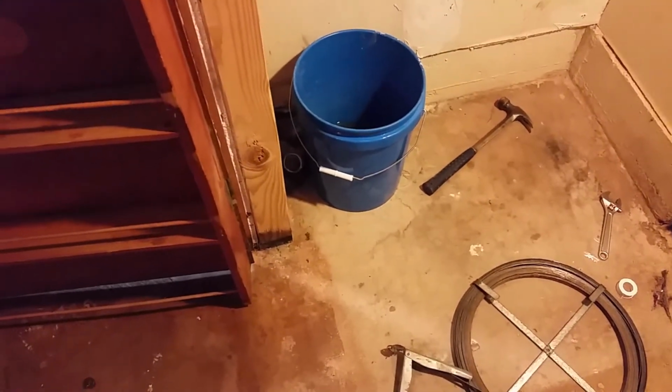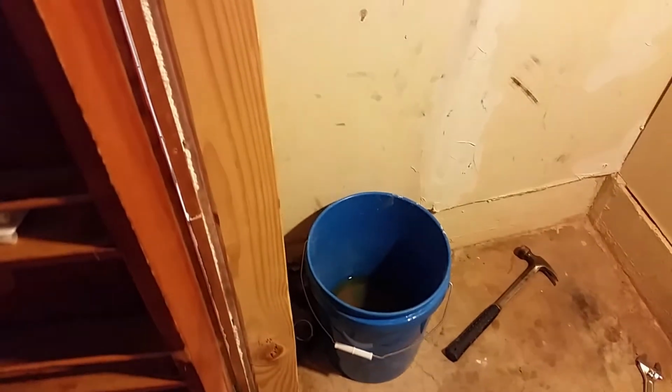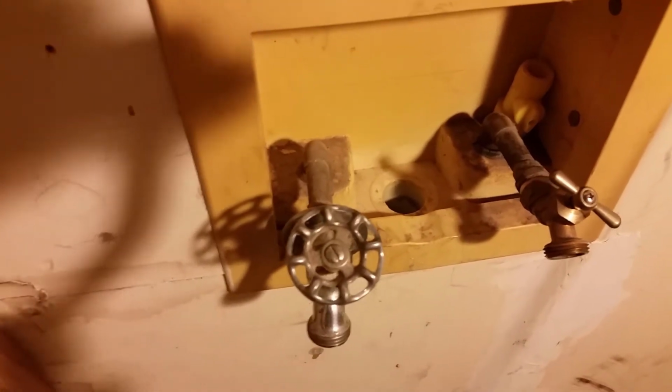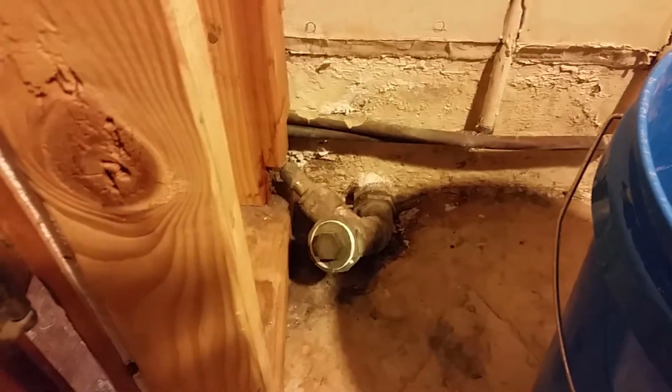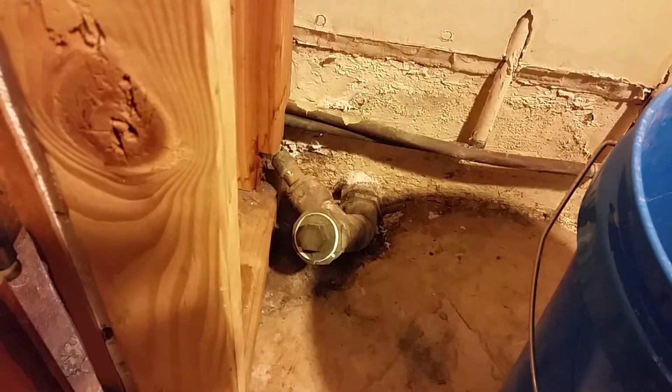I was getting water coming out all over the floor. We couldn't figure out where it was coming from. What I really thought was the pipes were broken underneath the sink and that it was running down behind the tile. But what it was is it was actually clogged coming up over that, because that is actually just hair underneath the height of my sink. And it was running down inside and onto the floor. So all I had to do was get into my clean out and clean it out. It actually wasn't that bad. Used an old school type, just like that.